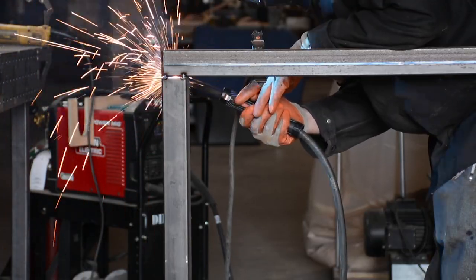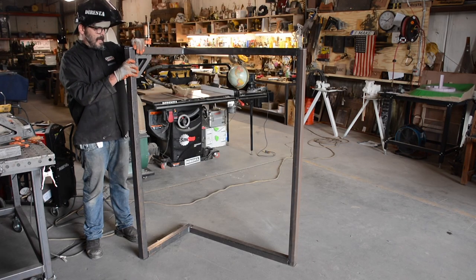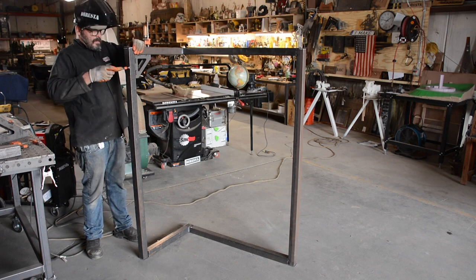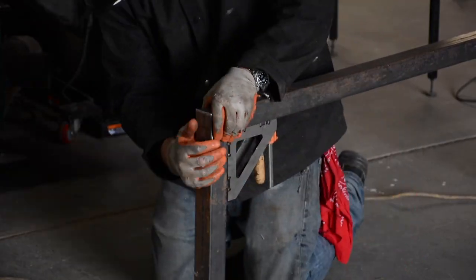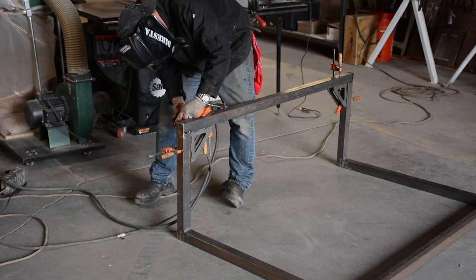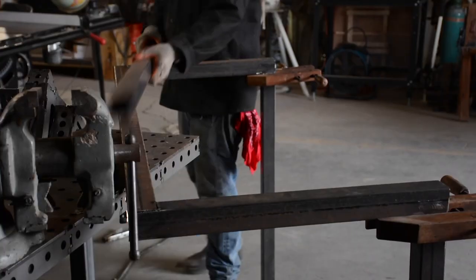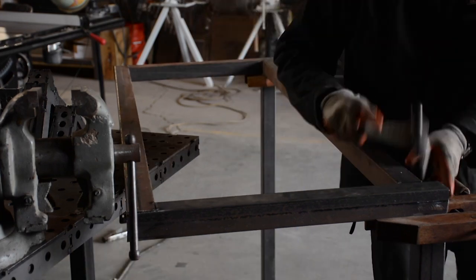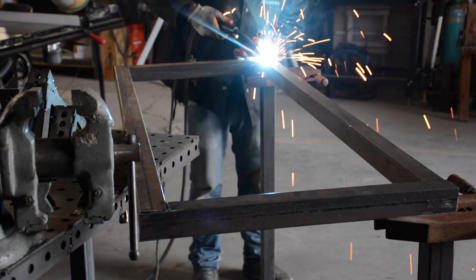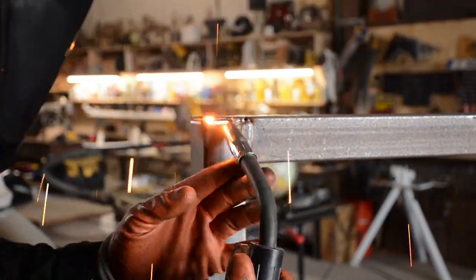Now I'm going 3D. I cut all my metal and I'm making a lumber rack, starting with this big L shape — the bottom is just facing me mostly, and the top is on the right side of the screen. I didn't cut the piece that's missing in that corner yet because I wanted to make sure I had all this welded together and knew exactly what that dimension was before I cut it. I cut it just off camera and got it to be a snug fit, making sure it was the same on the top and the bottom.